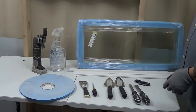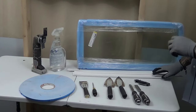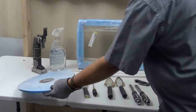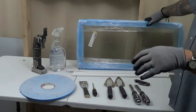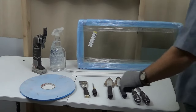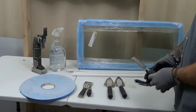If you're doing a new window, sometimes those glazing strips might not need to be replaced, but just make sure — if you're doing an older window, sometimes those get brittle and chipped. Maybe have some of that from the manufacturer. Also, the sealant here — we have this two-sided sealant. Make sure to get that correctly from the manufacturer. Stay away from silicones and that kind of thing; you want to use something actually designed for windows. Another thing we'll need is a scraper, a screwdriver, and a chisel — like a one-inch or inch-and-a-half chisel.